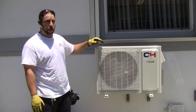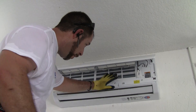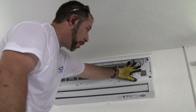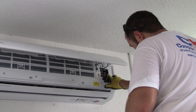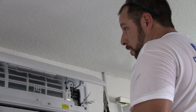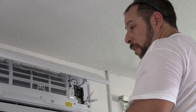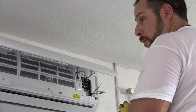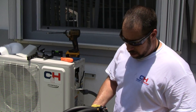Once the protective covering is removed, you'll find the filter access and the panel for the electrical hookup — that's where you hook up your control wire and line voltage wires. Make connections to terminals one, two, and three, and make sure the unit is grounded from the air handler directly to the condenser. A good tip: take a picture with your cell phone of the connections so when you go outside you can verify that wires one, two, three on the air handler coincide with the condenser. If not connected properly you'll get an E6 error code.